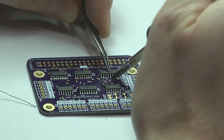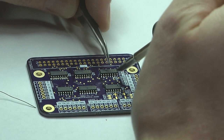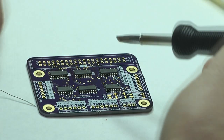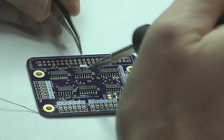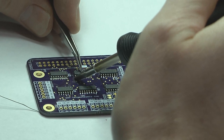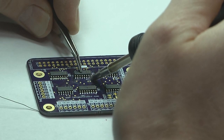On this one I didn't have quite enough solder — you can see I'm struggling to get it to flow. If you're working that hard, you probably don't have enough solder. I also look like I wasn't holding the tip perfectly flat onto the board.